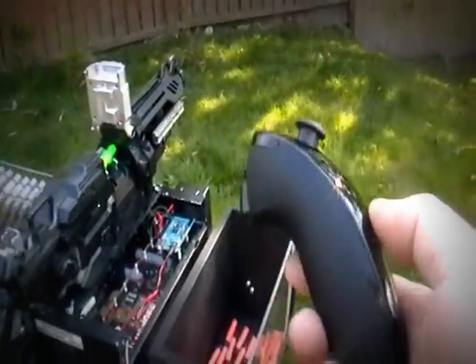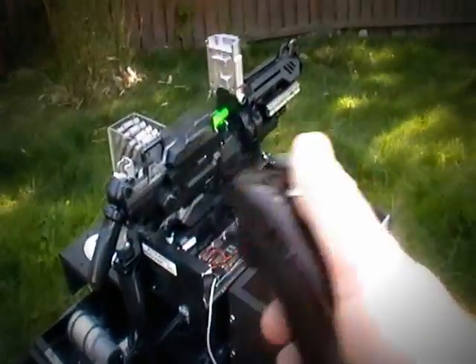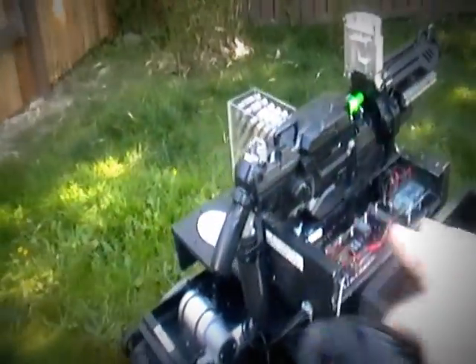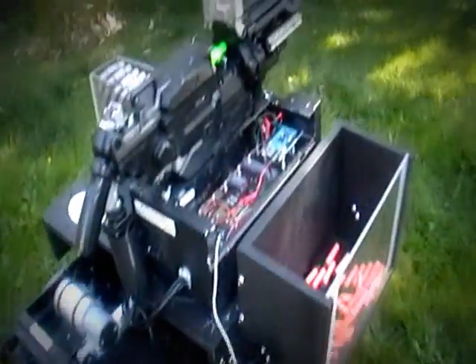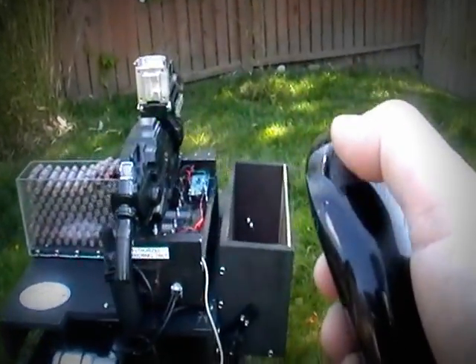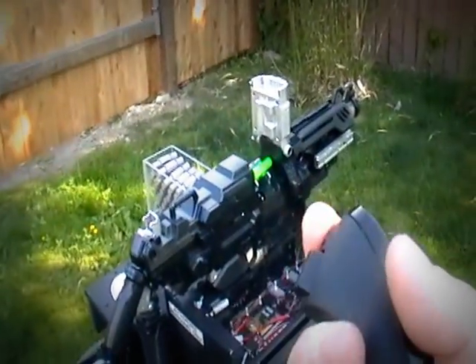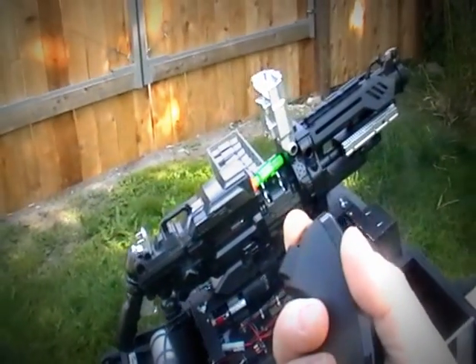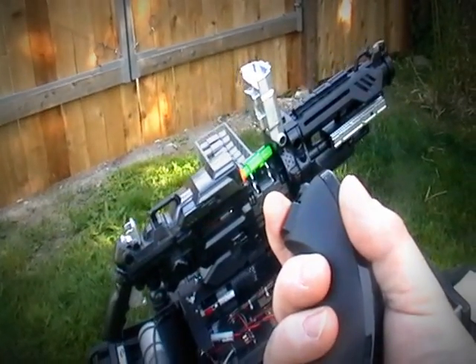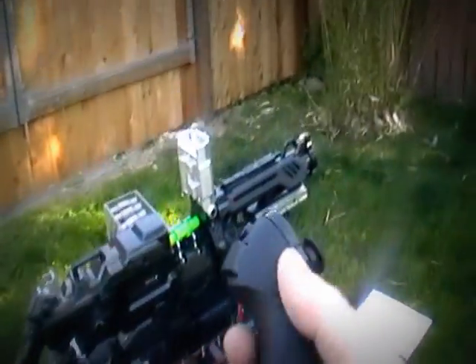I've got a little extension cord — I think it was like three to five bucks from Amazon. The Nunchuck accelerometer isn't being used right now, but it will be used to control some RGB lighting throughout the project — as you move the Nunchuck around, it'll constantly be changing little ground effects. My movement is all controlled by the joystick, and that's all run through the Arduino and sent to the chair. The C button tilts the chair up, Z tilts it back down — all running through those relays. These aren't analog signals, this is just high or low.